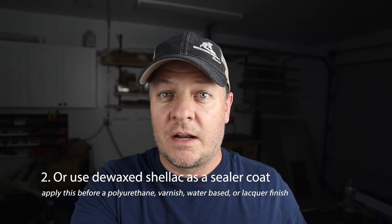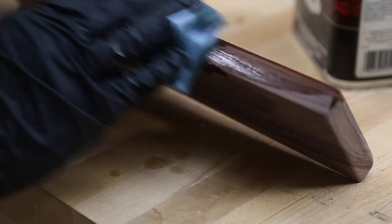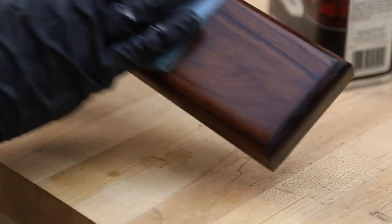I've used de-waxed shellac in a lot of previous videos on a lot of different types of finishes — you can search our archives for tips on using that. To be frank, I've used tung oil and boiled linseed oil on this wood. I just did the first coat super light, super diluted in a very light coat — wipe it on, wipe it off — and let it alone for about 24 hours. I haven't had any problems with that kind of finish taking, as long as that first coat was really light.